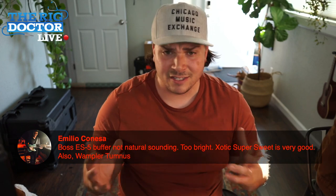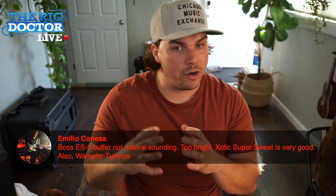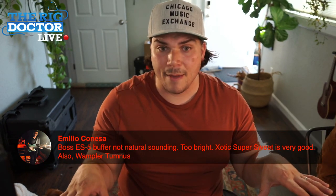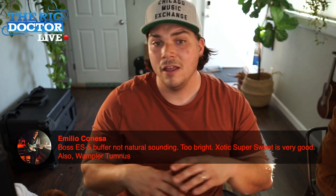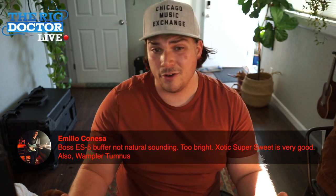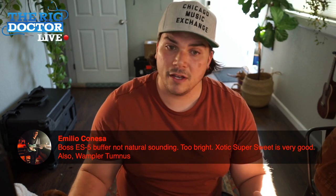I don't mean linear like it's stiff. It's just not doing anything. It's just taking what you put in. It's a one-to-one amp. What goes in is what comes out, presuming everything is true bypass and it's not hitting any other buffers. It's going to maintain that linearity throughout. And if it's a good quality buffer in that spec, you could presumably drive like 100 feet, on average, before you'd see any sort of instability or loss of any kind.